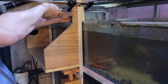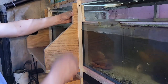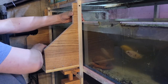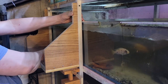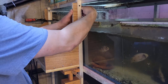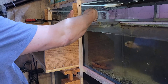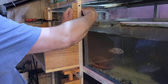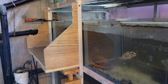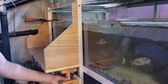After the holes are drilled, just take the clamps off and put the bolts on — gently by hand first, just to make sure it stays where I want it. Off camera I'm going to drill through some washers to make sure they're the right size. I'll put them on the wood here — this side is the end of three-quarter inch plywood, so there are layers there. If I bolted this down hard, most likely I'd split the wood and ruin the seal I have on it. That's the reason for the washers. The washers I have are not stainless steel, so I'm a little concerned they'll rust — I'll put a layer of silicone on them.